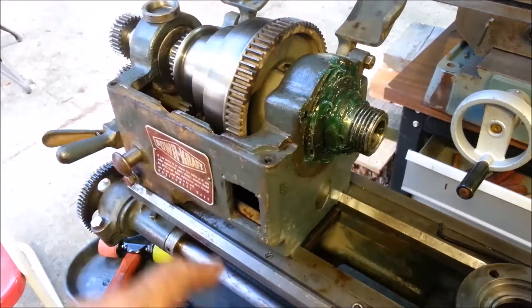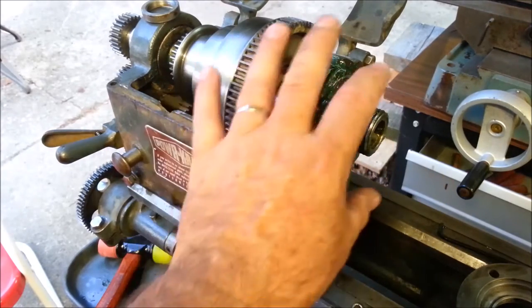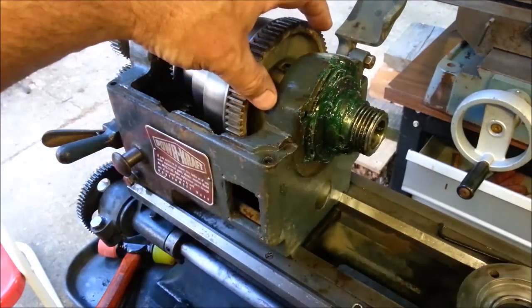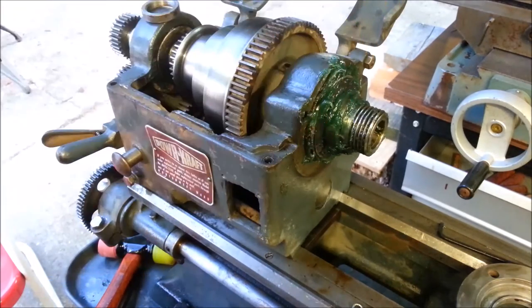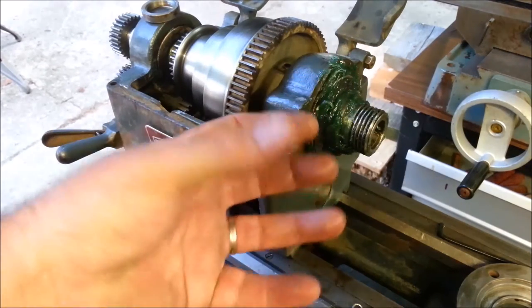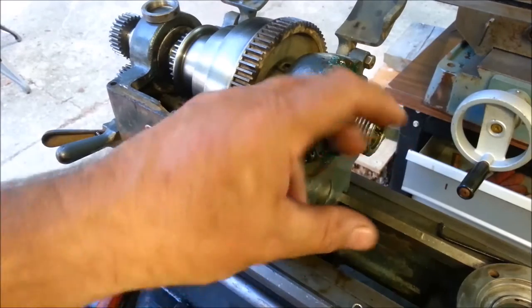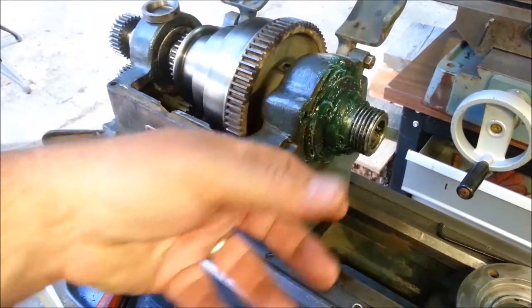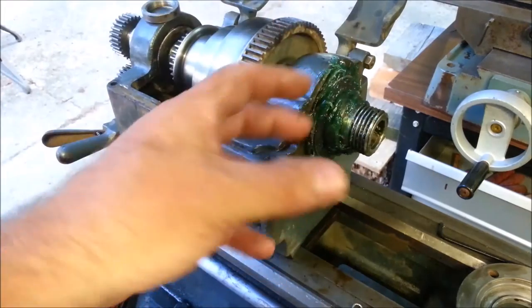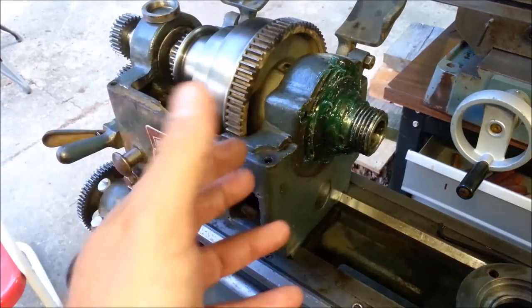I've put oil inside the cone pulley. This bearing here — I didn't have a way to hold the spindle in order to remove the nut that retains the bearing. I rinsed that bearing out with solvent because the grease was really dry and chunky in it, and then it actually started turning worse. It may have been that the grease was allowing the balls to slide. I rinsed them in gasoline and now the bearing feels beautiful.